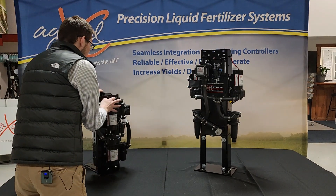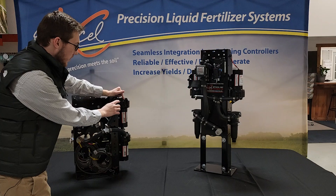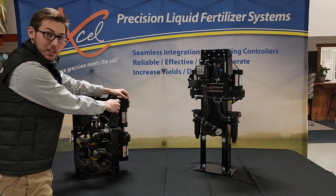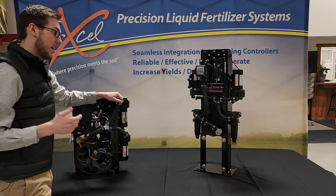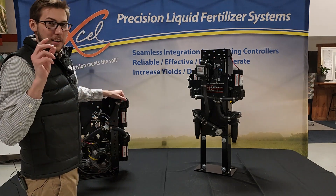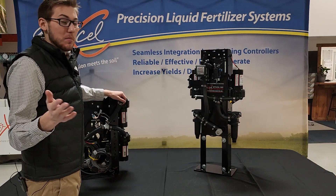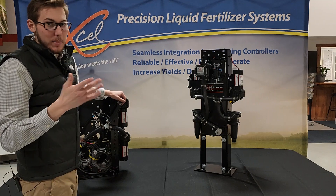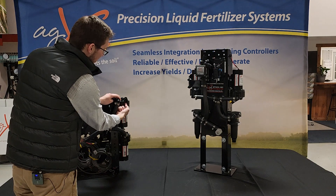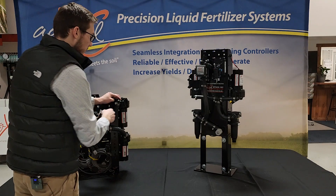As we come out of the two 12-volt pumps, on the outlet side of these pumps, you will have a check valve in here. Sometimes what will happen when these pumps get a little bit older is these check valves will get stuck, or if you're using a really sticky product, get a pair of needle nose pliers and pull them out. It almost looks like a spearhead-looking piece. You don't have to have it in the system, but it is nice to have to prevent any sort of backflow, but if your tank is sealed, you shouldn't have it backflow anyways. And this is a quick release system. On this tab, you can push up and unlock the elbow, or you can put it back in and close it and that will lock your elbow in place.